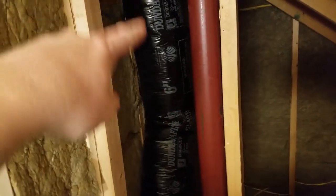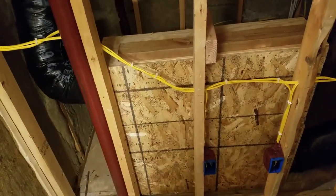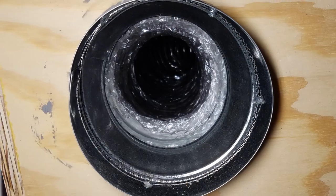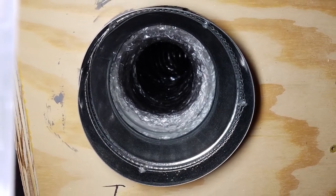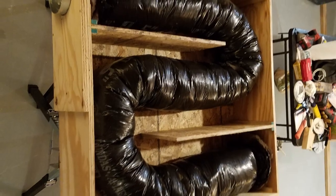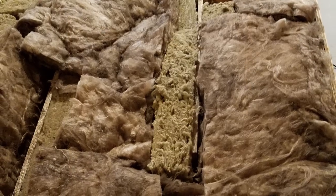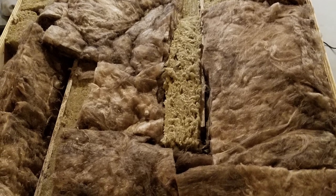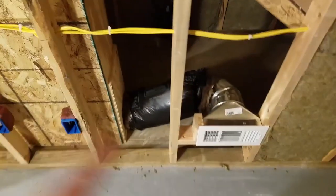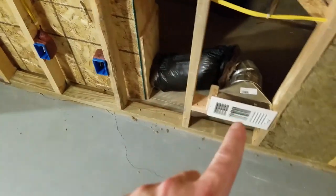I use a 6-inch flexible conduit that goes into this box. The box is 36 inches by 36 inches, about a little over 10 inches deep. Inside there's an adapter that takes it from 6 inches down to 5 inches conduit, then it snakes around — I'll cut in pictures showing you with some boards — and each one of those turns helps cut down the decibels. I stuffed it full of Roxul Safe Sound insulation, then it comes back out into another 6-inch flexible duct and into my actual vent.